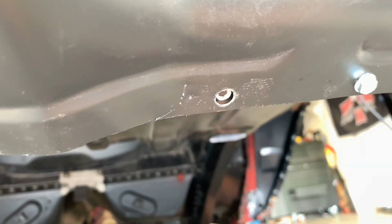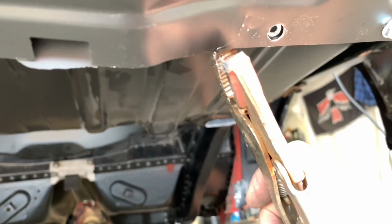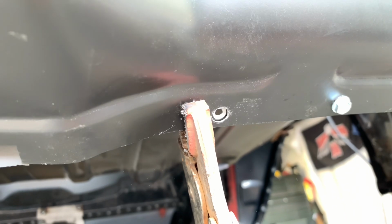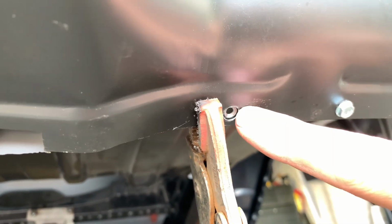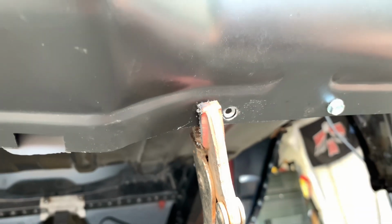It's still drilled out okay, but that's not going to weld very good. So it's all right to come back here. I don't know if I showed anybody this or not. I mean, clamp it like that, and then that pulls that gap shut. So if you get it where they pop apart, no big deal. Clamp it, then weld it. A little tip I want to show you. But now, go ahead and finish burning all these in.